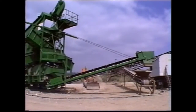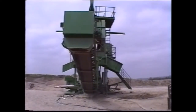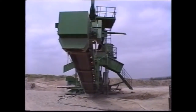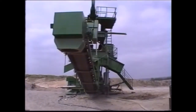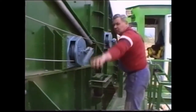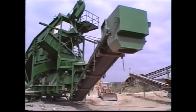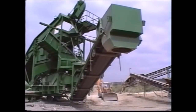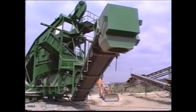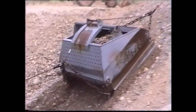In the vicinity of Bad Breisig stands this drag scraper type KS-400SH. Like many others, this plant is also equipped with a slewing feeder belt. In this case, it is slewed by hand. The purpose of this installation, as already pointed out, is to align the feeder to the best position for charging the overland conveyor. That is, the hydraulic walking equipment locates the drag scraper optimally and the transfer point is fixed.